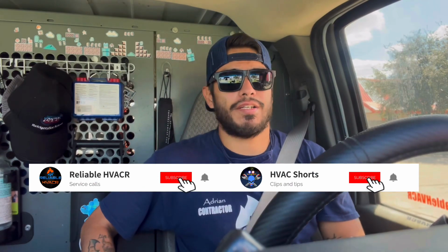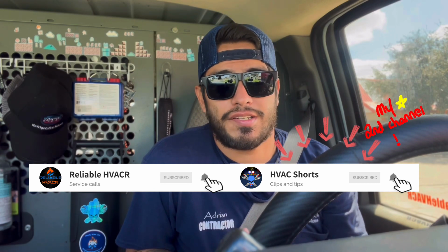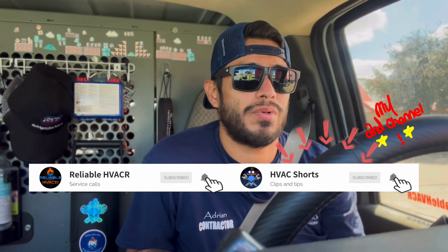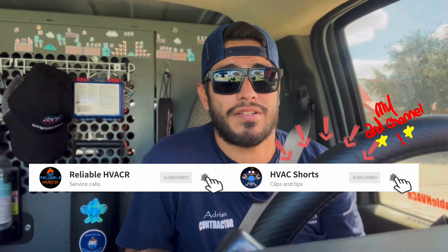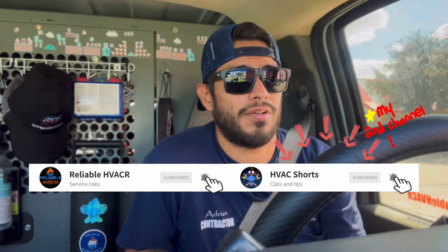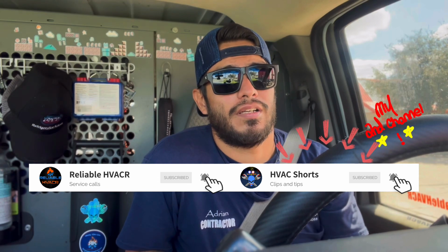Alright guys, so finished that one. Just had to charge it up as best I could, fill it up. It's a freezer, and you're not really gonna stay to the set point unless you're willing to be here all day. The box was very hot because the fans were off, probably for the whole day. I want to say they said they found it early this morning or late last night. I'm not sure which one. So either way, it's gonna take a while to drop down. It did drop pretty quick to 15 degrees, so I'm pretty confident that it's gonna drop.